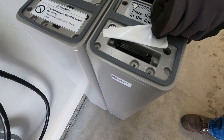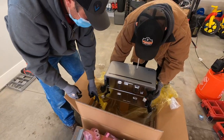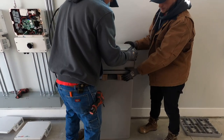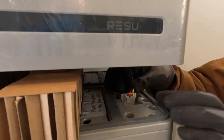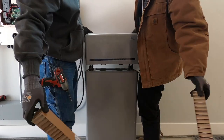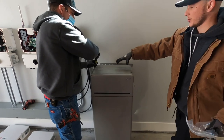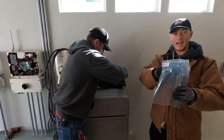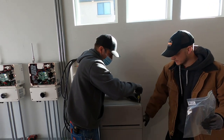This is where the battery connections will be. Here's the battery control unit — you've got to get this set up and then plug in the wires. When you plug this in there's a little red tab; press that tab in. Next, take the top portion of the battery off — that's going to expose the area where you need to put these long flanges in. Those flanges will go down and connect the top portion of the battery to the individual battery packs, and at the same time you'll also put a plate down that'll connect the battery back to the wall.